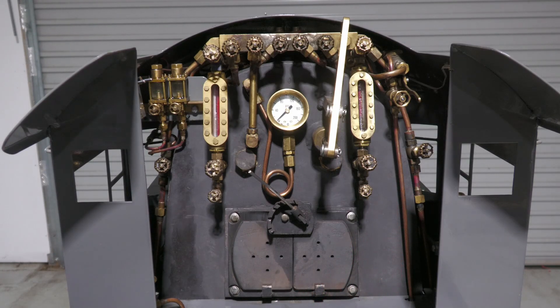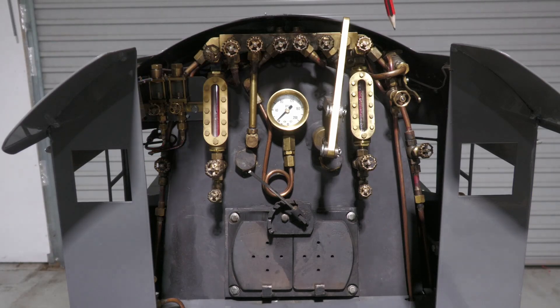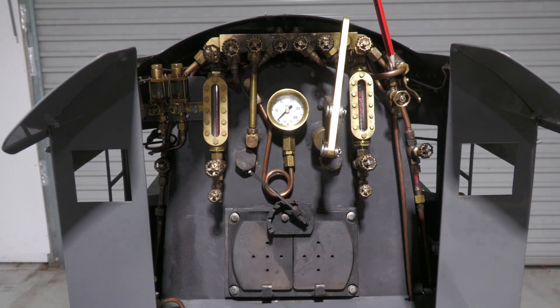From the turret we have the feed to the hydrostatic lubricator oil tank, the blower, feed to the weir pump, feed to the air compressor, feed to the dynamo which will be installed at a later time, the feed to the cylinder drain cocks, and the whistle.